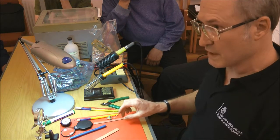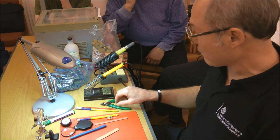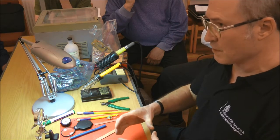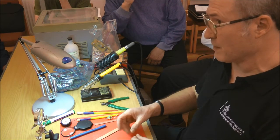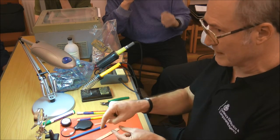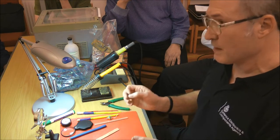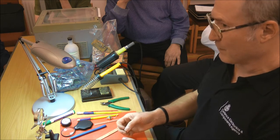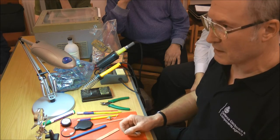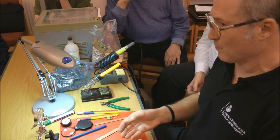The main thing with soldering and getting decent joints is cleaning things. And I fell foul of that when we did the surface mount training. The printed circuit boards we had were prepared, all brand new, the components never used, and you're looking at very small things with like 120 connections around them. We use microscopes for that level of work, but I hadn't bothered to check it under the microscope first, so I started to fit this device, and would it solder? It would not. And I had 3 attempts at cleaning the solder off, so I couldn't remove the device.